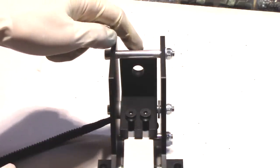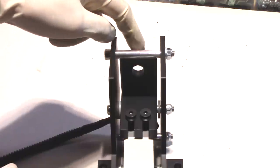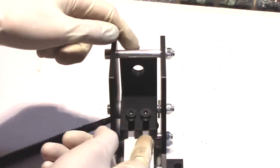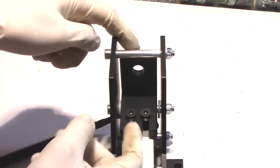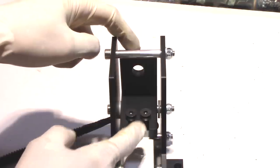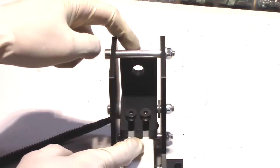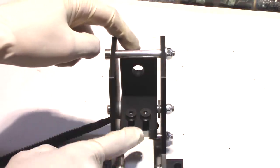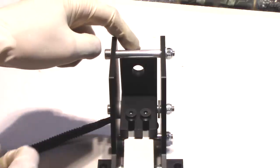The polyurethane bushings push against this back bracket on the top. The shaft goes through the center hole. This bottom part gets pulled up — it pulls up on these two bolts, and these two bolts are attached to the load cell. So when you press on the brake, this thing pulls up on the load cell, which gives you your feedback in the game.